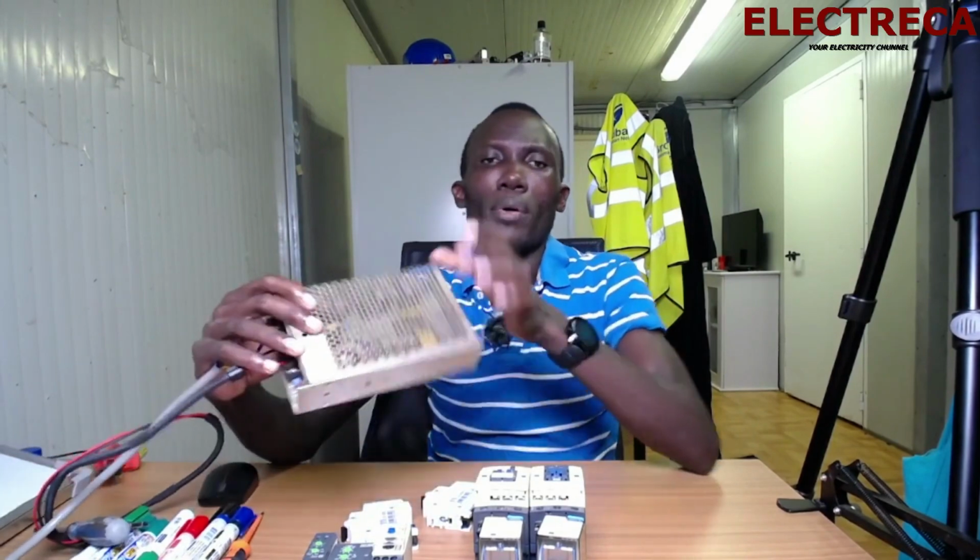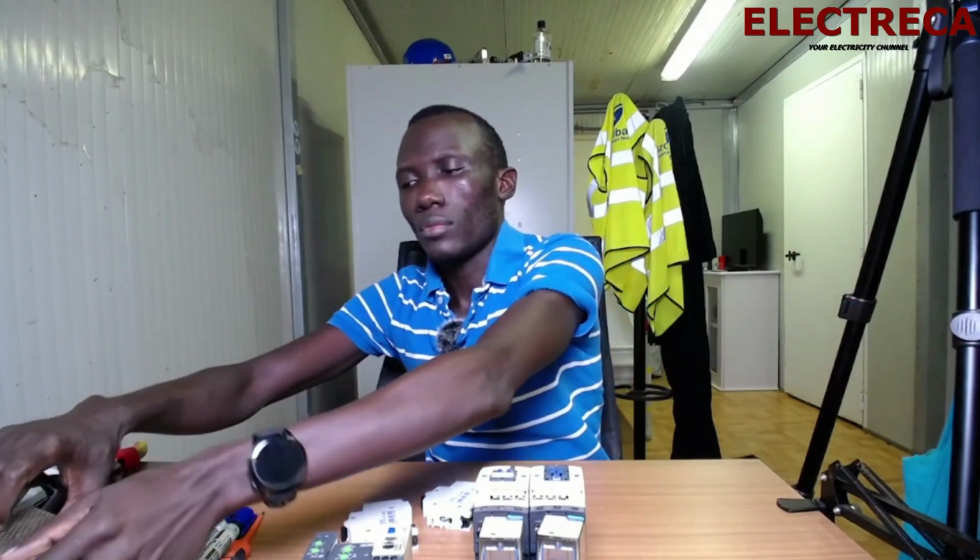Now, with changeovers of this kind, you either have a transformer or you have a power supply of this nature incorporated in your panel. That means each side will have a power supply, because the power supply has to be powered from independent sources. If it's the generator side, it has to be powered from the generator. If it's the main side, it has to be powered from the main side. To demonstrate that, I did a video previously, which I'll put the link in the description and the info card. If you're interested, you can go watch that video.